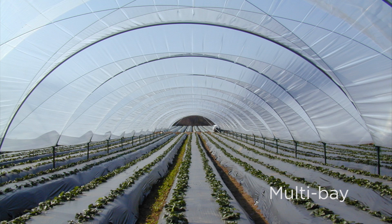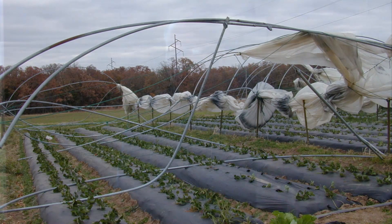These field scale tunnels were made originally to be taken down — they were not a full-year structure. These posts have augured tips on them; they're actually augured into the ground. You hook the hoops to them and put the plastic on. After the crops finish, you take the plastic off, take the structure out of the field, and move it. But it takes work. So people were trying to do these as full season structures, and they're cheaper — there's not as much steel — and they do blow down. This is our structure here, but this one didn't last for us. When we were trying to cut our costs and see how it worked, it was not acceptable.